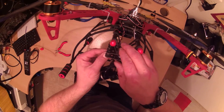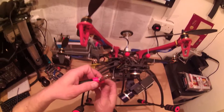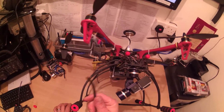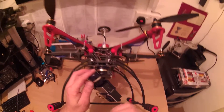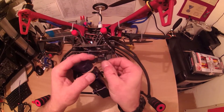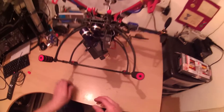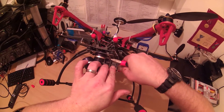I wet it slightly and pushed it through until it comes through the other end about three or four millimetres — hopefully you can see this. Then all I done was chop it off three or four millimetres proud on the other side. Line up the gimbal ball hole nice and straight, wet it slightly with saliva to help it go in, push it in snug.